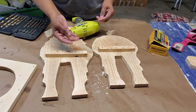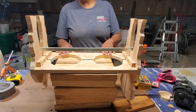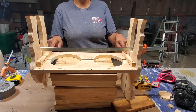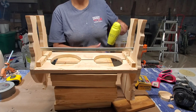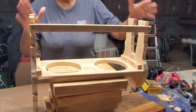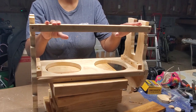I'm going to use one-and-a-quarter inch screws to hold it together. I set the piece on top of a pile of wood and held the side pieces on with a big clamp. I pre-drilled the holes in the little blocks before attaching them because it's awkward to drill against them once assembled. I'm using a right angle adapter to drive the screws. To give the stand more stability so it won't rock, I added a support bar at the back — you just place that part against the wall.